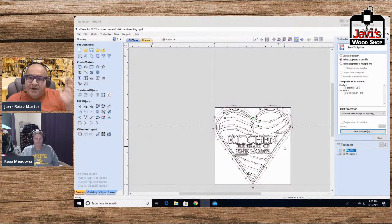Then go to Mach 3. Now you're in a different program. Open it up, run it. If it runs great, you're done. If you see it doesn't run that well, go back to your original, tweak it, and copy it again. And always remember to recalculate. For those of you beginners out there, calculate toolpaths.